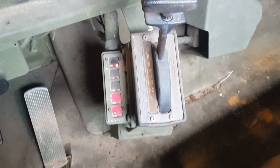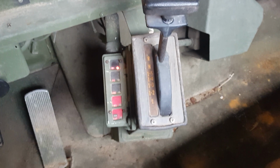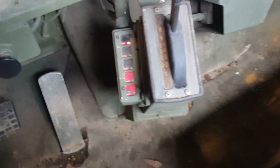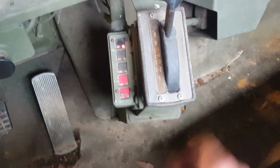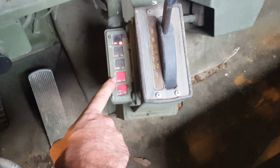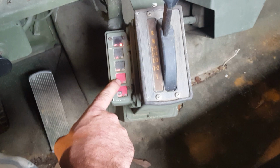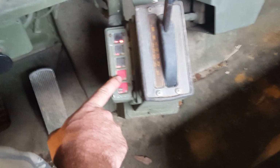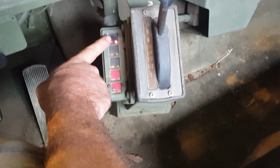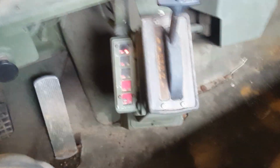But it makes the same sound when it gives up, and then all 6 of your lights, or all 5 of your lights, start flashing. So if that happens, if you've got all of your lights flashing, what you can do is push both your run flat and your emergency buttons, and hold them down at the same time, and then those two lights will start flashing, and you'll hear it cycling air. And when it reaches its lowest pressure, I think it goes to run flat or emergency. It goes to one of these. Whichever pressure it reaches that it's happy with, it'll go to that, and the light will stay solid. Once it does that, it's got enough air in all of the tires evenly that you can go to the highway setting that you want, push that button, then the light will start flashing and it'll start airing them all up to highway pressure. And usually that'll work as long as you don't have a bad wheel valve or something of that nature.